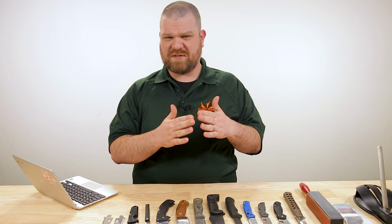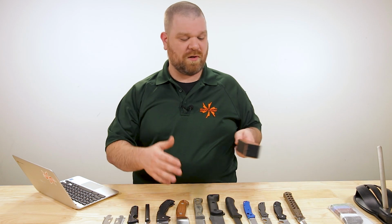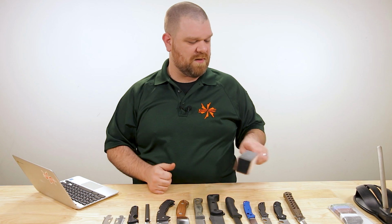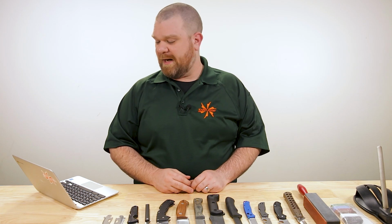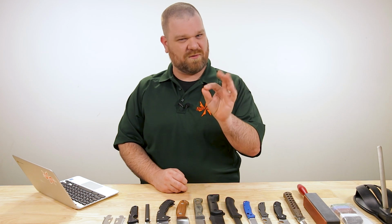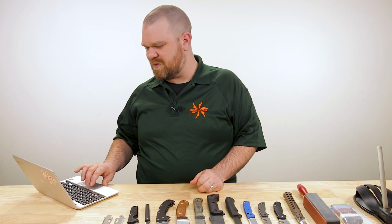And if you're almost there but you're still not getting it, strop. Again, learning how to finish things out with a strop after whatever sharpening method you're using is really going to be a big help. Leave a link to maybe our whole sharpening playlist down below. Yeah. Something like that. But stropping is always the thing that takes the edge from almost there to right over the top. Yeah, very, very good thing to know how to do.